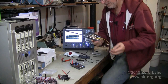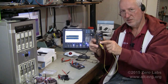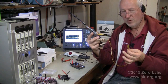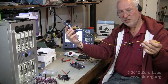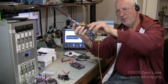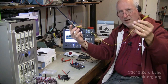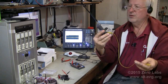So that's a wrap. I will be attaching a black antenna off the base of the existing antenna, going in the opposite direction from the existing antenna. It will simply hang out of the bottom of the case and dangle, and Russ can place this wherever he wants to. What this will do is it gives a much broader surface area for it to receive the signals on, so that if the instance of multipath canceling happens to occur here on the antenna wire, it certainly would not be out here on the antenna wire, and there will at least be some part of the antenna wire that is in the field that is not being canceled and receiving some signal to the receiver unit.